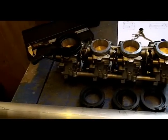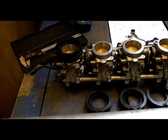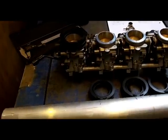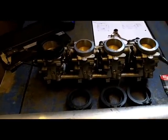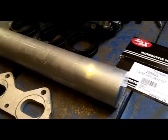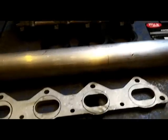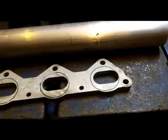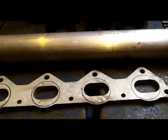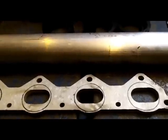I am about to make up a manifold for the throttle bodies off of a Yamaha R1, about a 2002-2003 model. I've just bought new inlet rubbers, and I bought a chunk of 2 1/8 of an inch, which is about 53-54mm, a bar which I am going to turn. I have been supplied with this manifold which fits the Citroën Saxo VTS.